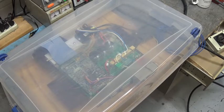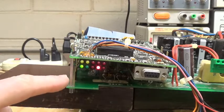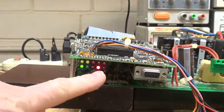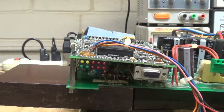All right, I'll move the camera to the front of the CPU board there, and you can see the LEDs are lit up. There, we got our green power LED on and our EXT dot LED on. That just means that we ain't got 24 volts applied to the front connectors from an external power supply. I'm going to cycle power, and you can see what it looks like when it powers up. All right, here we go again, applying 220 three-phase to R, S and T.